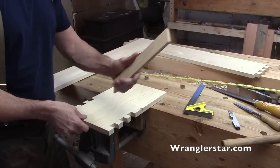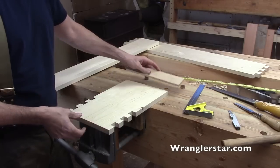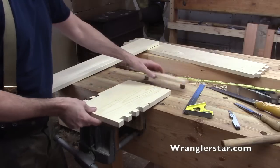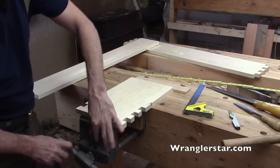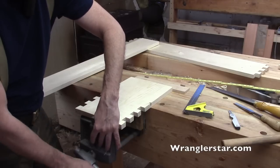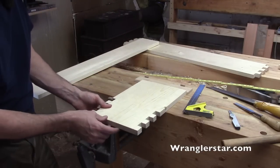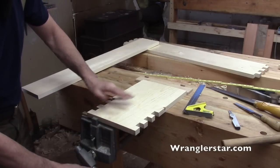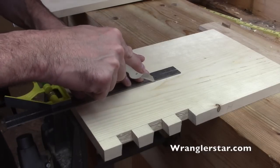This is my main bench. I've got this little piece of hickory that I use all the time — it's cut about a quarter inch or so, stays below my material, and spans the gap so I have some adjustability. I put it in here and I can simply hold the piece in place so it doesn't move around. I can offset the dog a bit; it doesn't take much pressure to hold it there.